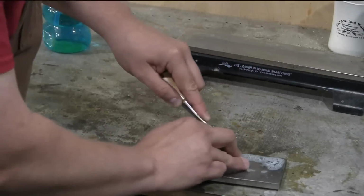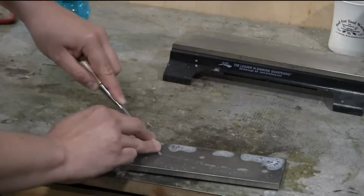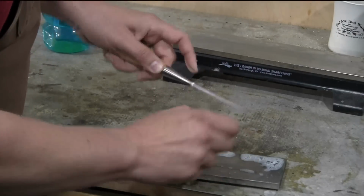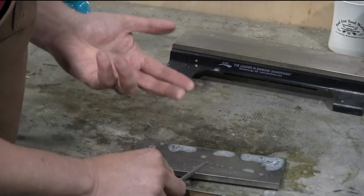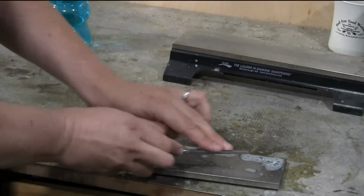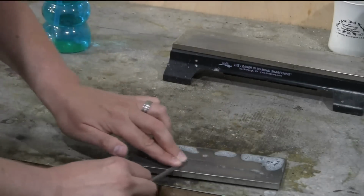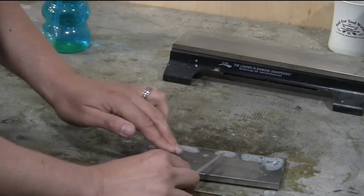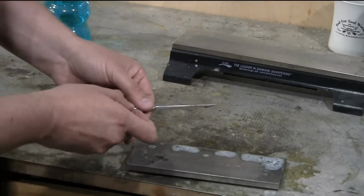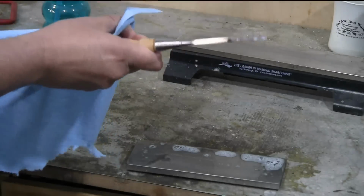What they're doing more than anything, because my fingers are coming in at close to 90 degrees, I've got this outrigger thing going on here that allows me to keep it very stable. And that chisel has got a burr on it. So if you were to come down and lap the back of this, you wouldn't want to lap it this way because the handle gets in the way. I'll lap it side to side and I'll put 2 fingers down on it and run it back and forth. And those 2 fingers keep me from rolling it, because a narrow chisel like this will want to roll a fair amount. It's the same thing going on the bevel. Use those 2 fingers as an outrigger.